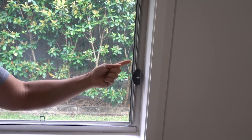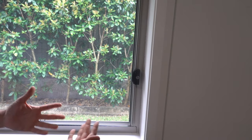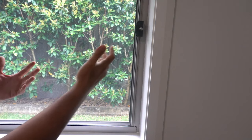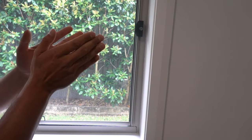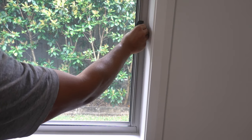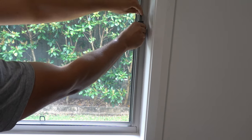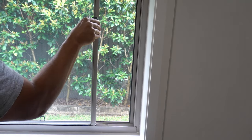The first method: the window is currently locked and we don't have the key. What you want to do is slide your window lock mechanism up into the lock position and put it basically in the middle of the frame — that's where we get the most flex. On the back of the lock there's a little groove that catches onto the lip of the aluminium frame. Pull the window frame towards yourself and twist that lock. It's made of plastic so put a little bit of pressure on the back and you should be able to clear that lip, push it in towards the frame, pull back on the lock and unlock it from the inside.